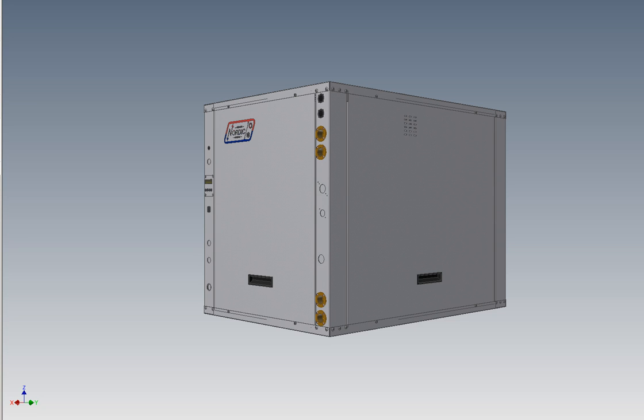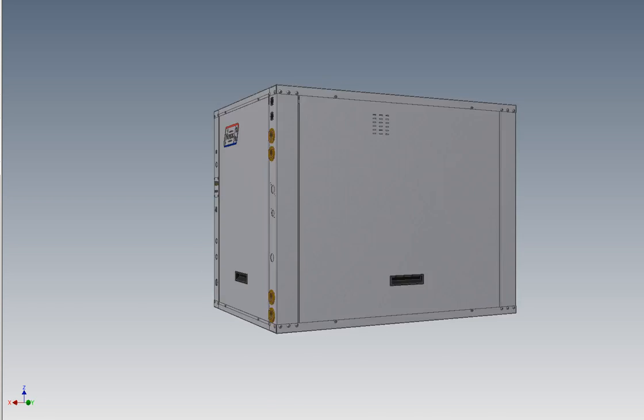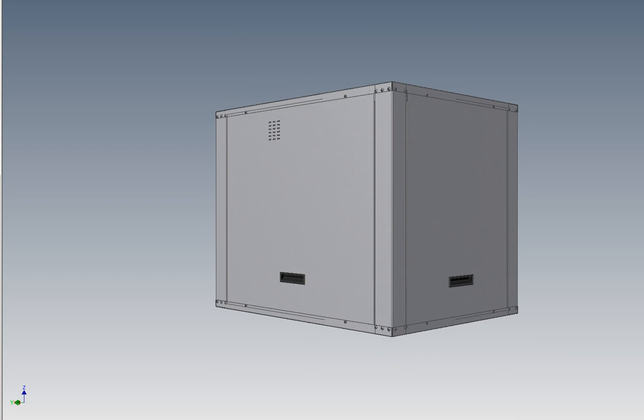What is a water to water heat pump? A water to water heat pump is a device that takes heat from a lower temperature liquid, usually a ground loop, and puts that heat into higher temperature water, usually for use in space heating. The possible range of water temperatures on both the source and sink sides are determined by the characteristics of the refrigerant used, specifically its pressure-temperature relationship.